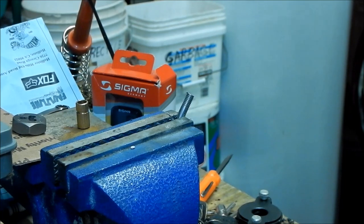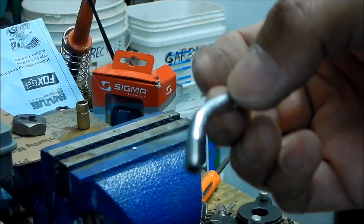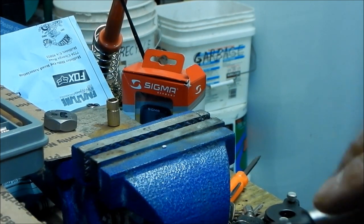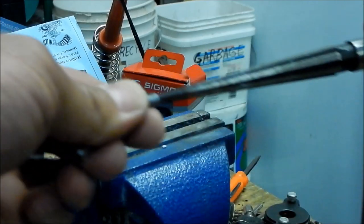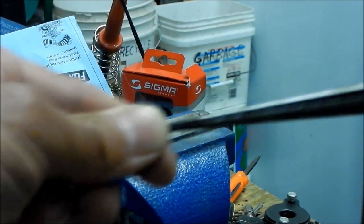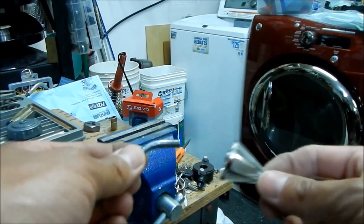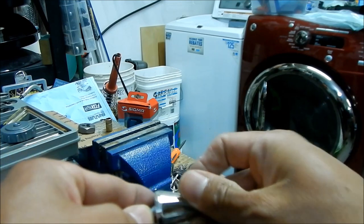Okay, it was pretty tough to cut. What I'm gonna do now is try to open up the passageway — it kind of closed up a little bit. We're gonna use this reamer to open it up a little bit. Okay, looks good. I'm gonna use this little tool I bought a while ago to clean up the thread — this little tool deburrs the thread so it won't get all tangled up if you didn't cut it straight. I think you're supposed to put it on a drill normally but it's so small I'll just do it by hand.